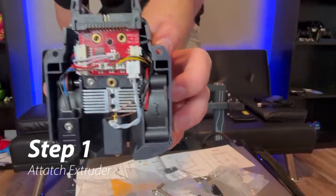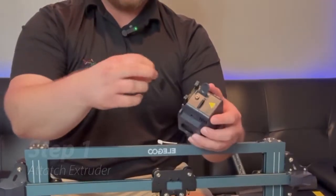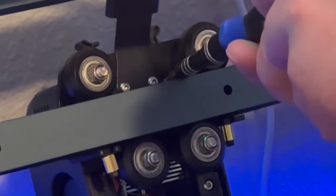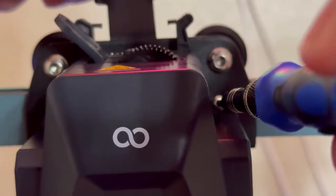When you're doing the extruder, the gold holes are the screw holes for the x-axis bracket, and then the small metal piece just kind of attaches to the back as well. You're going to use two PM 3x8 screws and three PM 3x14 screws. The three longer ones are going to go in through the back and the two smaller ones through the front.